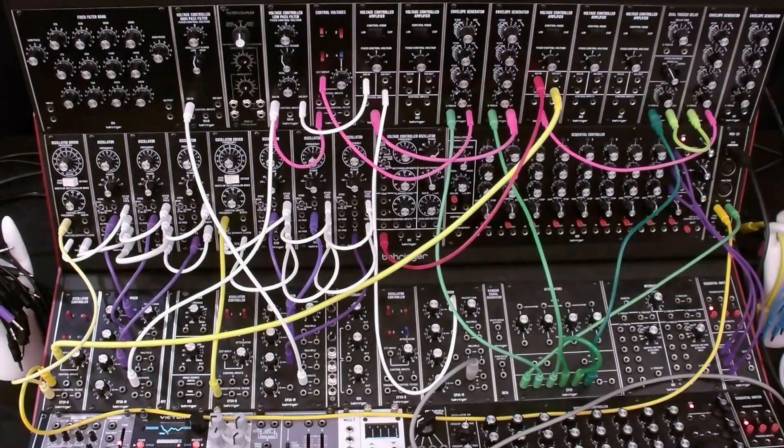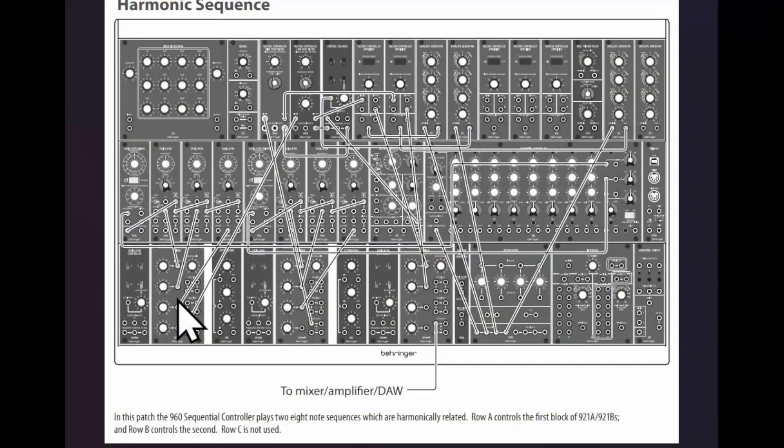So let's look back at the harmonic sequence layout. We've got our two banks of oscillators set up and the oscillator mixer set up. We've connected to the high-pass filter and the low-pass filter. One of the big differences here is that we're going to take our gate out of the oscillator output from the sequencer. Similarly, we're going to take our control voltages from row one and row two and route those to the two banks. So let's pause and implement those changes.